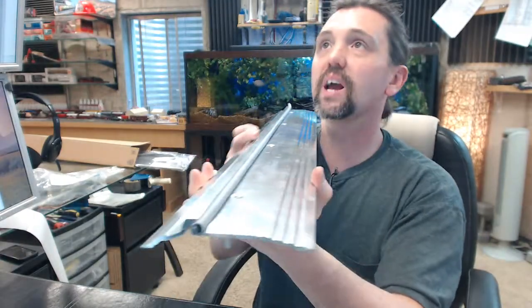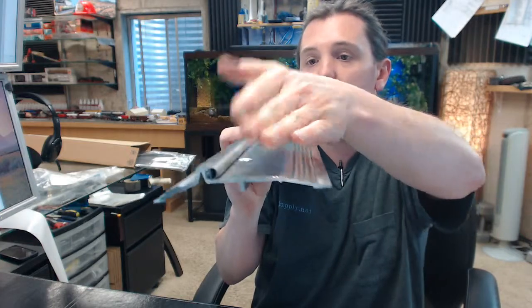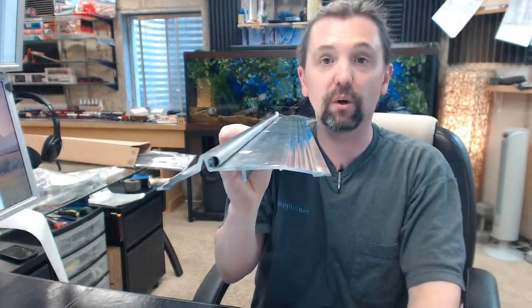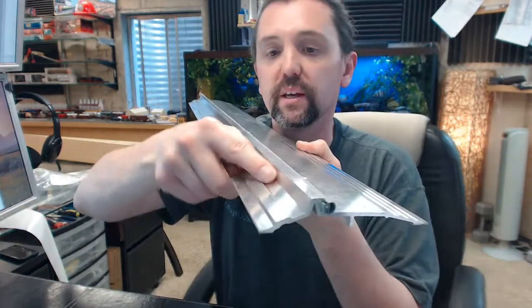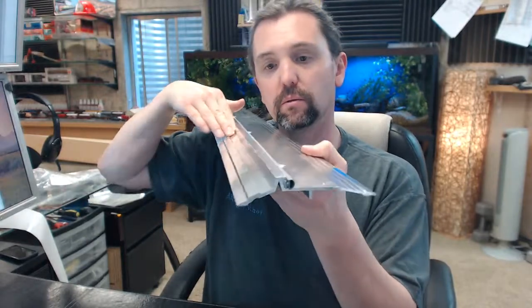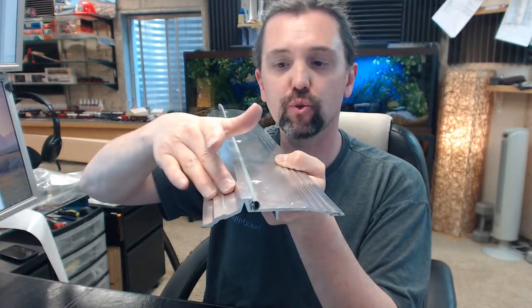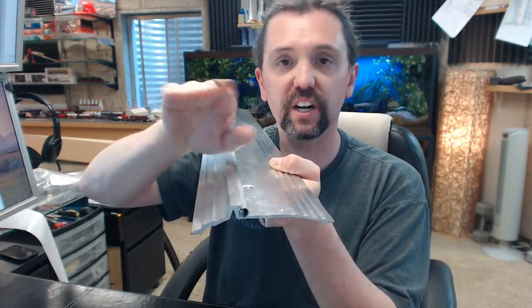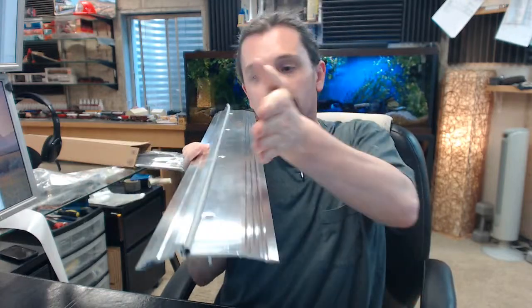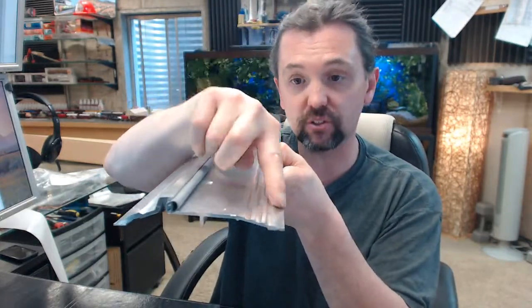Bump up, you can get the concept here. That the door is meant to bump up to the edge of the Latchtrack threshold is a reference to the profile on the back side of the threshold, where a threshold like this is going to be used. And I'll explain the Latchtrack in a moment. Backing up, this is in an exterior application where you want your doors to positively seal up against a seal material. You can then optionally install a sweep on the outside of it to give yourself two areas of protection.